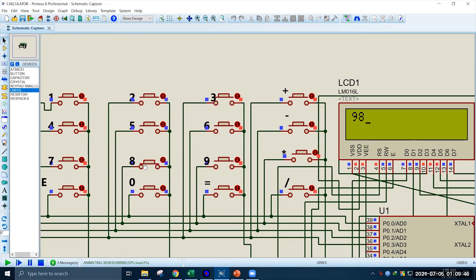Now let's move on to the division section. We input our first number 9823 and divide it by 5600. The result shown is 1. Why is it showing 1? Because the actual result is 1.75 — since the microcontroller can't deal with fractions, the result of division is always the floor value of the actual result. So the floor of 1.75 is 1. Similarly, if we divide a smaller number by a larger number, say 3056 divided by 8509, the result is 0 because the actual result is approximately 0.36, whose floor value is 0.